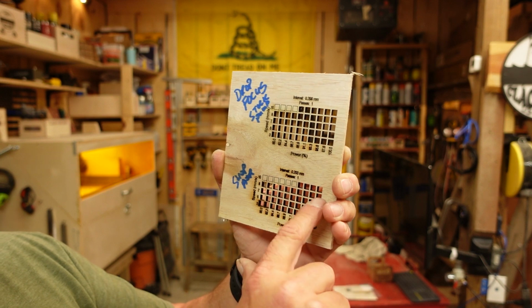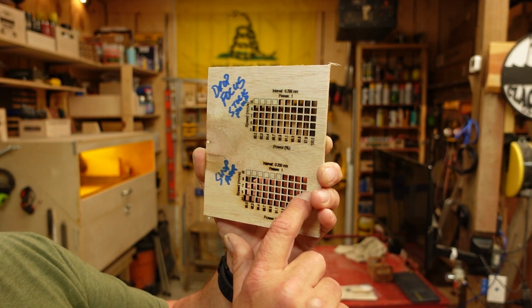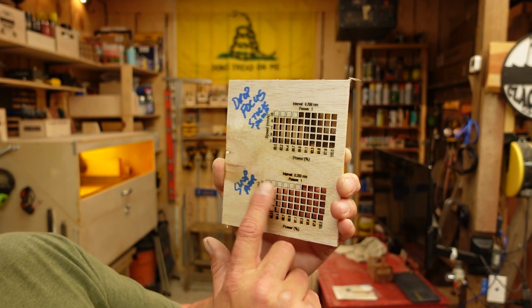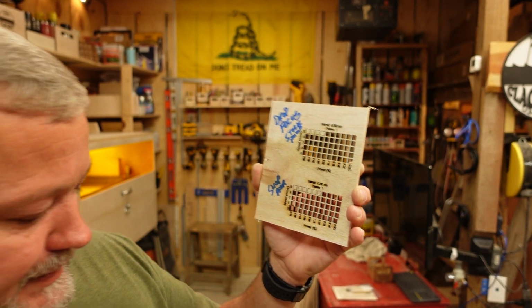So still at this position with the -2, I am well within the 8 millimeters per second cut range, and I've even got a little bit to spare. So effectively cutting at 8 millimeters a second with the -2 focal adjustment. And guys, that's really impressive to me.